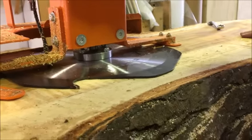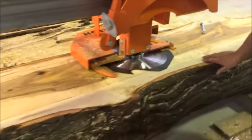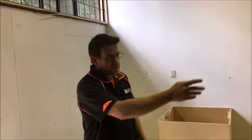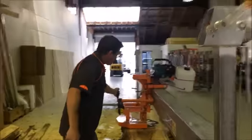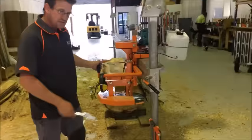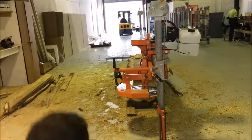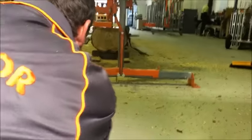So once that's done, we can move on to the horizontal lead-in. Now the horizontal lead-in is the tilt of the blade when it swings into horizontal. So the first thing I do when I go out on site and have a look at someone's machine is swing the blade into horizontal position, and I bring the machine back as close as I can to the skid.